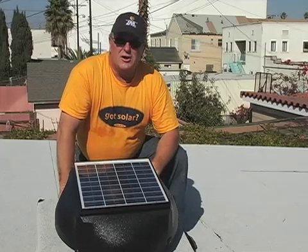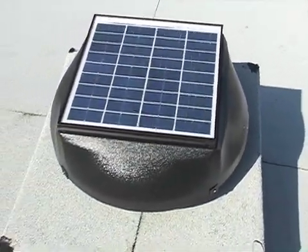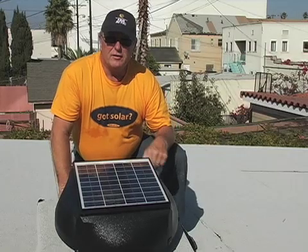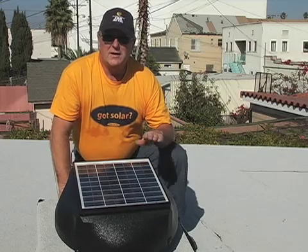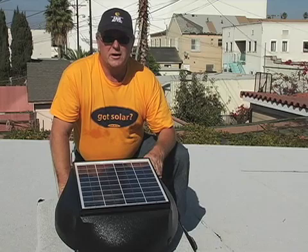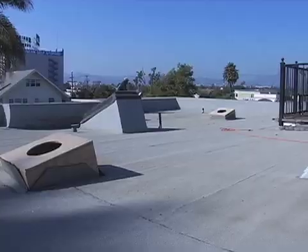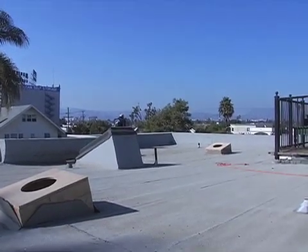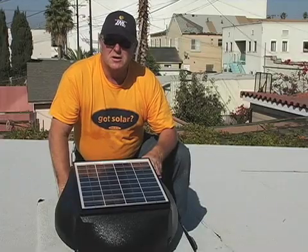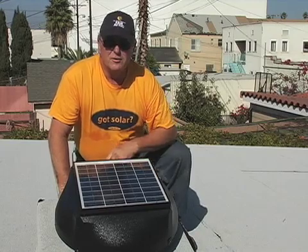This unit is in and installed. This is the Fan Attic by New Light Solutions. It's a solar-powered device that can run at 850 CFM. That dramatic amount of airflow pulling out hot air will cut down the heat load in your attic by 50 to 55 degrees. On an average 90-degree day, your attic could hit the high 150s or 160 — this brings it down to 105. That translates in a single-story home into about 5 to 7 degrees cooler, and in a two-story, about 8 to 10 degrees. That's a lot of money if you're running air conditioning, and that's how this thing pays for itself in one year or less.